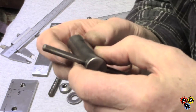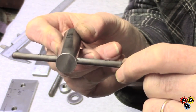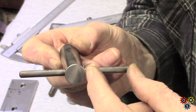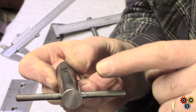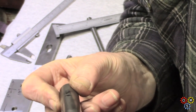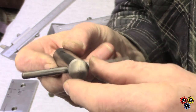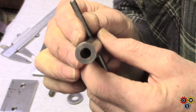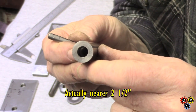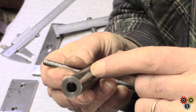That's 3.5 inch with a 1/4 inch T-bar, 1.5 inch both sides, nominal, and this is put in with a through hole and with some upset on the 1/4 inch so that it makes a tight fit. Now this is actually bored probably down to about 2 inch, but is threaded more or less as deep as could be managed, down to probably nearly 2 inch.